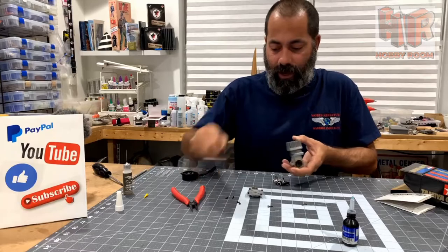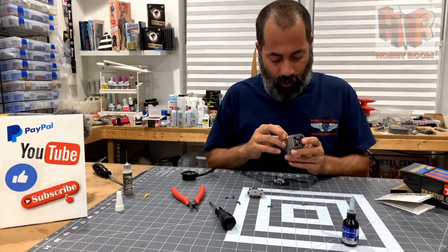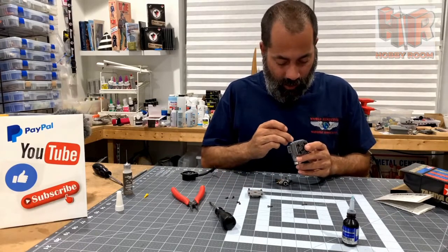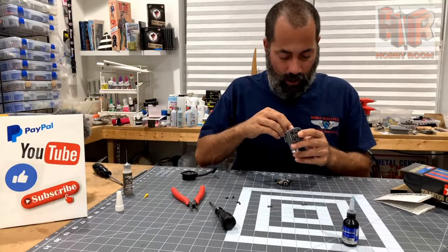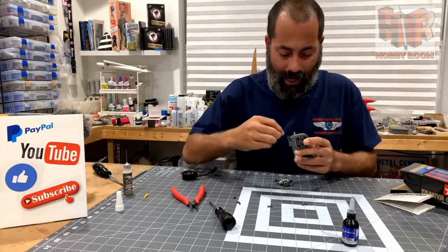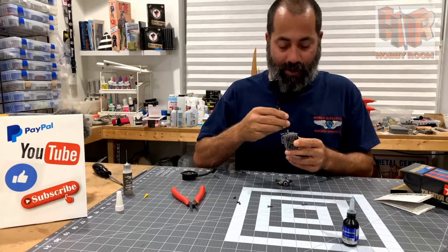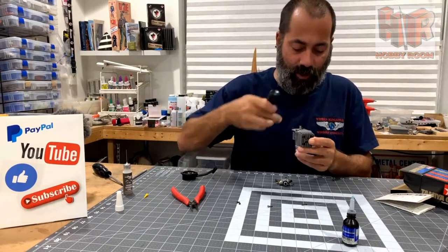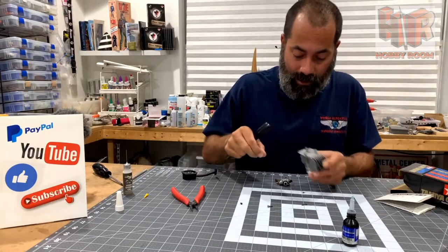That's why I loosely assemble sub-assemblies on occasion when allowable, especially when it's an engine I'm unsure of — I've never seen this particular machining characteristic before. Now I'm going to align the gasket as we had it before. We've got our interlock here that goes through there. I can see that's a bronze bush. There's no way our thread lock has cured in this time — thread lock cures in the absence of oxygen, not in the presence of it, so since we didn't have it starved of oxygen for very long, it's not set up.